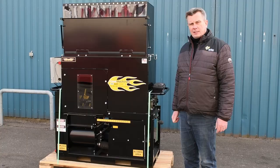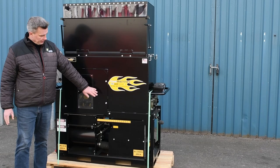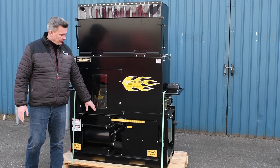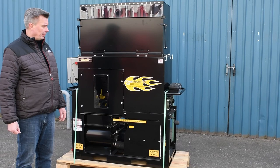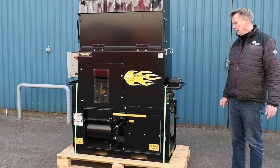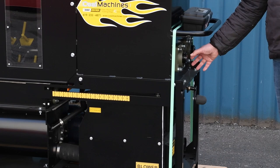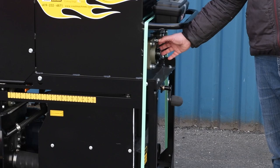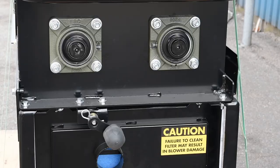One of the unique features of Cool Machines is that they are built in separate modular units. The airlock is an independent unit that can be dismantled and removed quite easily, and the blower box is likewise very easy to dismantle for servicing or replacing blowers. In general, all Cool Machines are very well engineered — in some ways over-engineered — meaning all bearings, shafts, and components are oversized, giving you a long service life with minimal problems. Running parts are slow-moving, so bearings will essentially last forever, and you will hardly ever see failures in these parts.